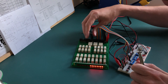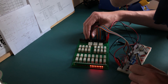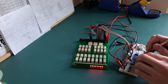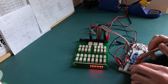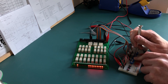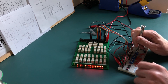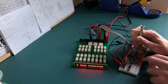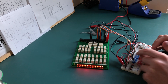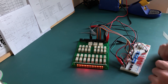So now if I switch to loading the high rather than loading the low — which is the tiniest writing on the screen print here — what I should expect to happen is if I knock all the bits off except for the highest bit and the lowest bit, I'd expect to see this one and this one come on, but this should stay exactly as it is. And that's exactly what happens. So I'll bring on three and six on my switch block — it should bring on that one and that one. And let's fill in the middle and then do the edges. So I know that's working exactly as it should. If I set all bits off and load, it should wipe them all back out again. So that showed from the exact same data bus I was able to load those values up with no problem.